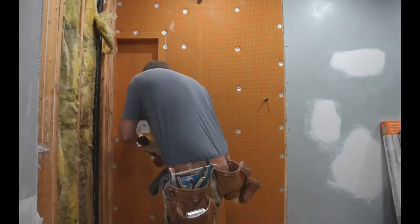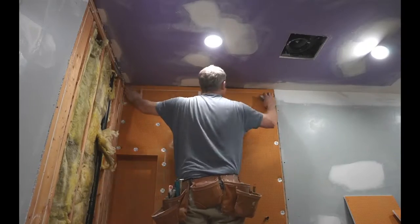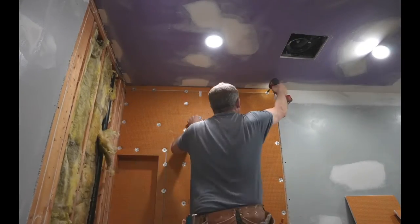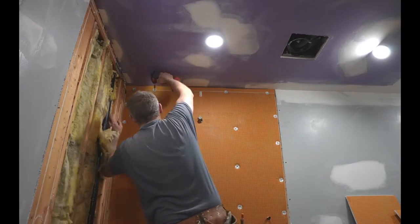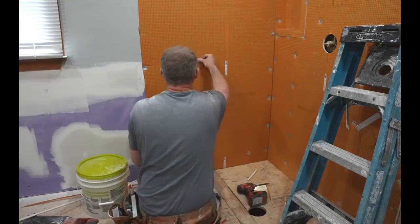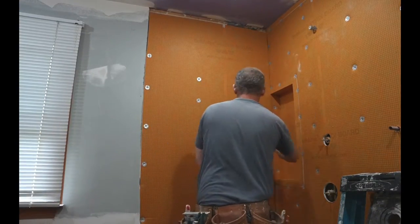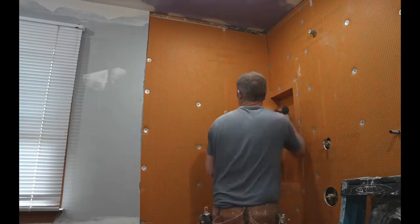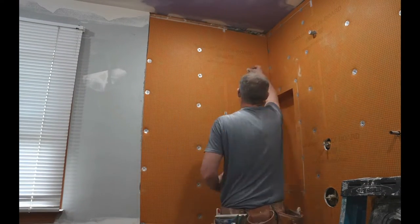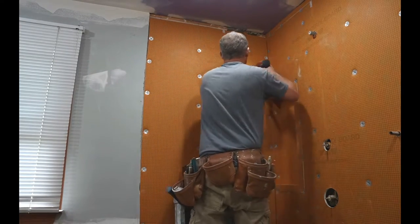I have a little small piece that I put in at the ceiling — it was a little bit more than 8 foot. We're doing the back wall here with screws and washers every 12 inches. This really is a fast installation. I highly recommend using a foam board like KERDI board for your showers.